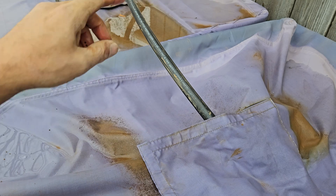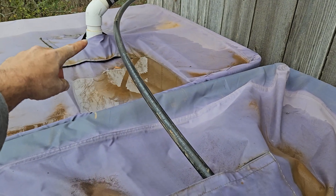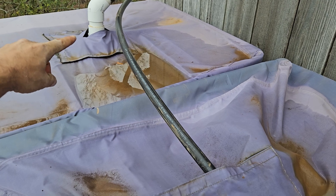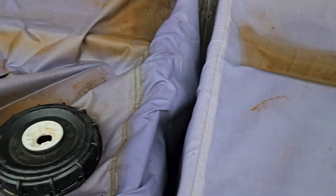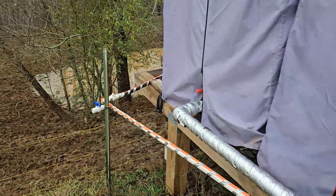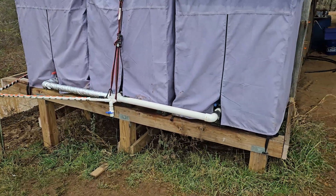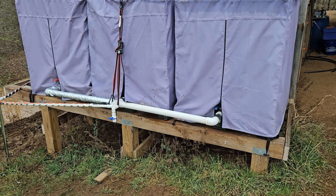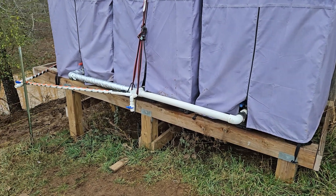What is going to happen right here is this is actually going to come out to a piece of half inch PVC, and I'm going to tee off here, here, and then put an elbow right here. That way, that nice warm water flowing through here is getting returned to all of my rainwater tanks simultaneously — they're all open. So hopefully this keeps these pipes from freezing.